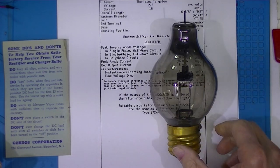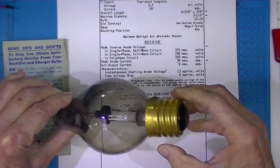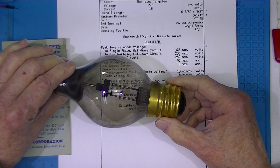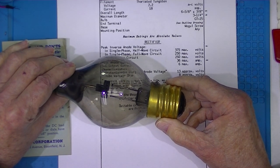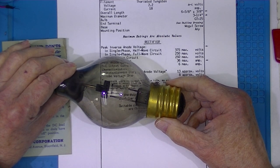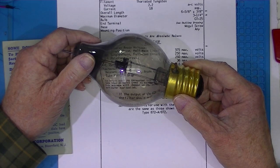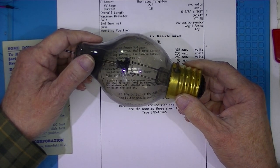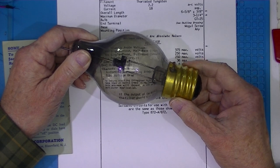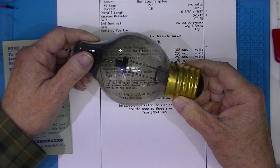This is a three terminal vacuum tube. It has a filament. This base is a large base — it's called a mogul base. Standard screw-in lamps in the United States have Edison bases. Back in the 20s, big steam locomotives were called moguls. When Hollywood needed indoor lighting they manufactured lamps with mogul bases, because often you find these on a 1500 watt incandescent bulb or bigger.